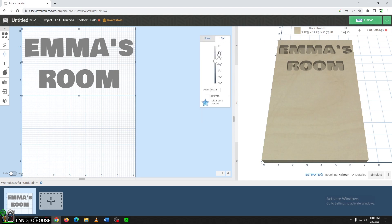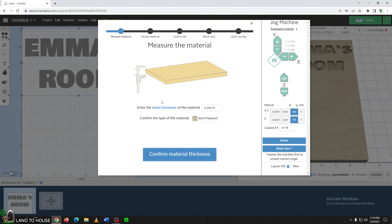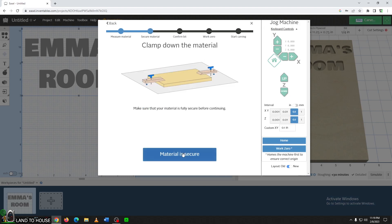I'm going to move this up just a little bit more so I have plenty of room for my other design that I'm going to do in a moment. That looks pretty good. If I move over to the cut settings, I only want to go down an eighth of an inch — actually let's go ahead and do a full quarter down there. Now if I press the carve button up here in the corner it's going to ask some questions. 0.75 inch — yes that's correct. Is it locked down? Not yet, let's go do that real quick. I'm going to turn this on over here on the wall plug.